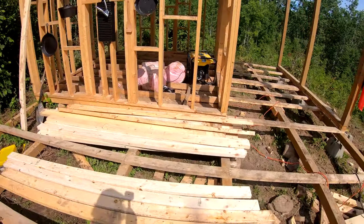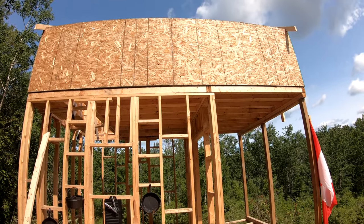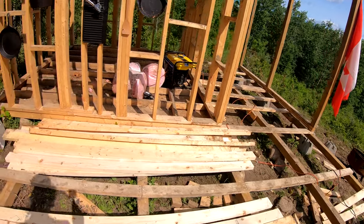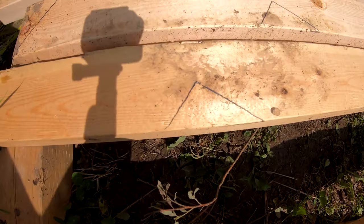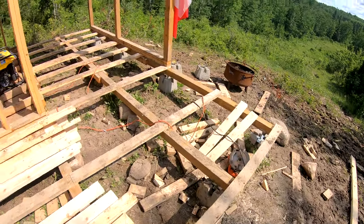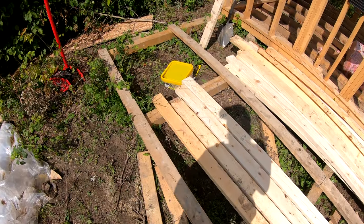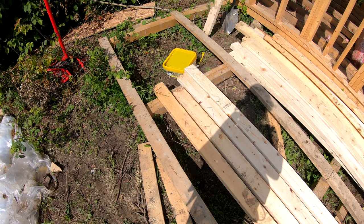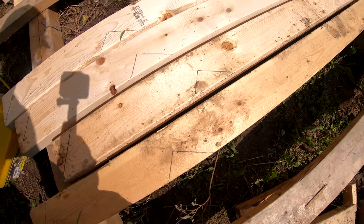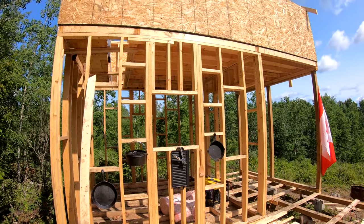I've marked out 20 to begin with — I'll probably need about 25 or so, but I'll start with 20. You can see all my bird's mouth cuts and my angles lined up there. I cut everything with a little circular saw. It's a little slow going cutting the angles, especially the bird's mouth — you gotta be careful, take your time. You should keep a hacksaw on hand because it seems like you gotta touch it up a little bit right at the peak in the corner once you're done cutting. Just take your time and give her.